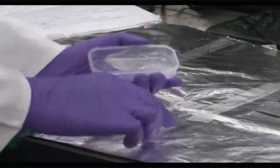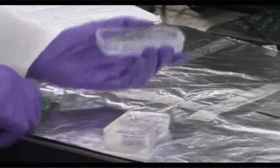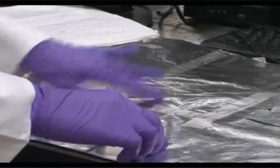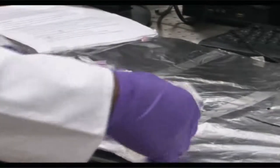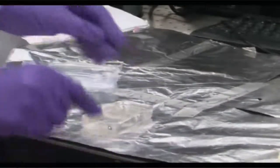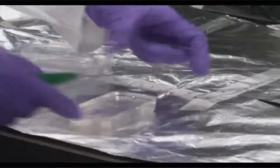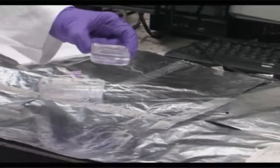You can see that it has come out quite easily, and you can trim off all the edges of this material. The material has to be cut and cleaved in the area which contains essentially the device part. The device part is quite visible, although because it is now PDMS over PDMS, the visibility has reduced a little because of the identical refractive indices of both materials. But you tentatively know where exactly you have placed this device.